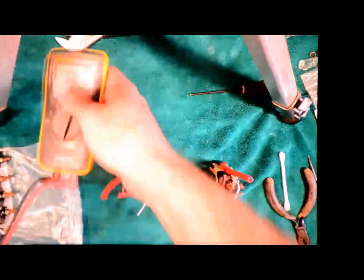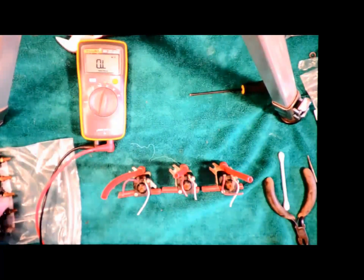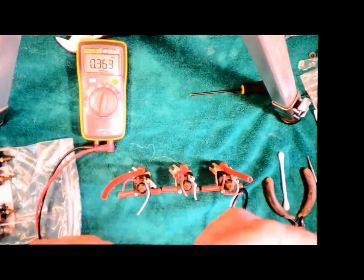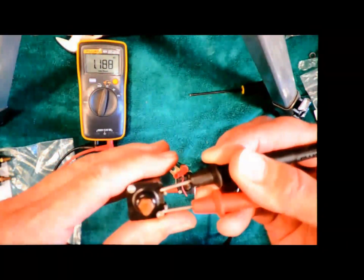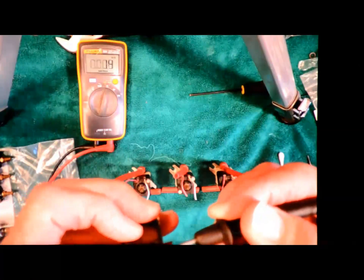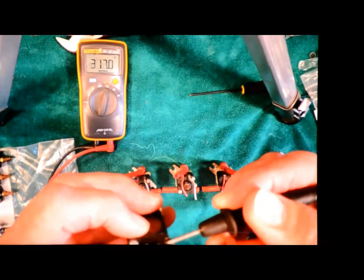Now the first thing I want to know, just to figure out electrically whether the valve's working at all, is this. Let me take one of the 24s that I know is working, and I'm looking at the resistance on it. When I measure resistance, it's about 1.2 kilo ohms. If I look at the 12 volt, it's going to be about 300 ohms. So that becomes a way where I can actually tell the two apart.